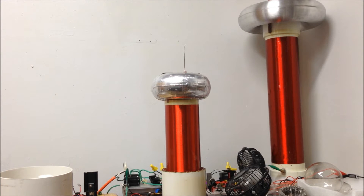With the FM modulation, which via slope detection turns into AM modulation — as you can hear — we get around 220 watts average power. It's 400 watts peak. So let me power it on, grab the tubes, and give you a show.